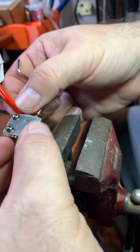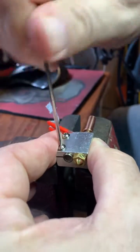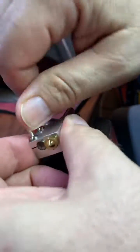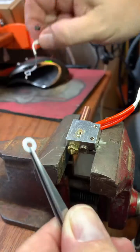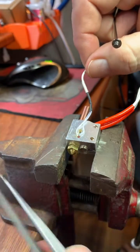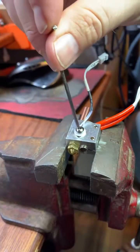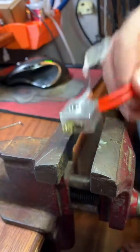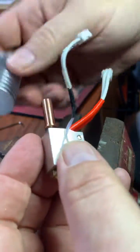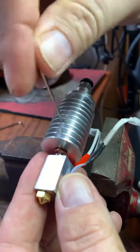The most important thing to remember about these Vipers and the Cobra Maxes: do not tighten, loosen, or adjust that nozzle when it's in the strain gauge. That is the fastest way to damage that strain gauge. It's meant to read up and down movement, not left to right — it is not meant to deal with the torque of pulling off a nozzle, especially a Volcano nozzle.